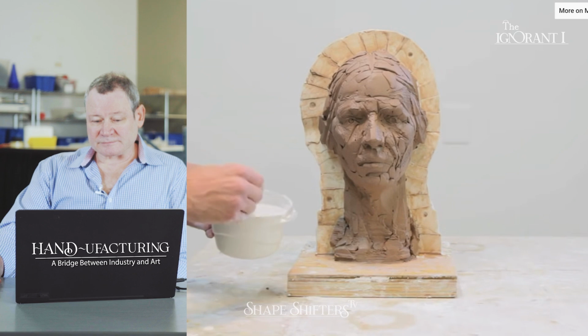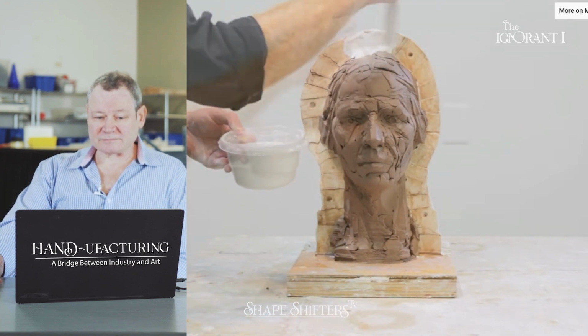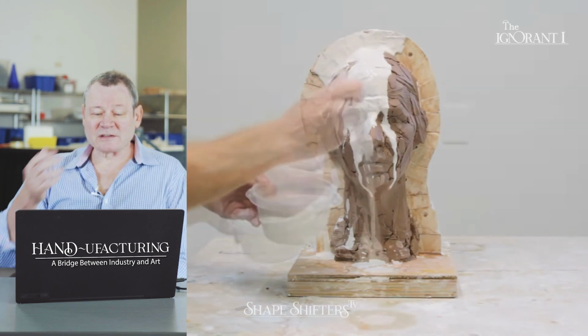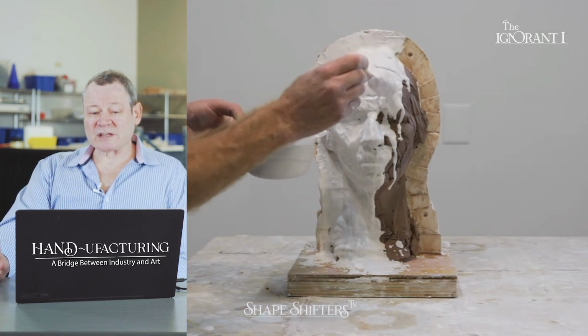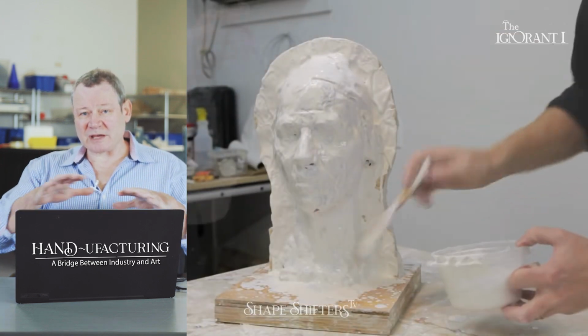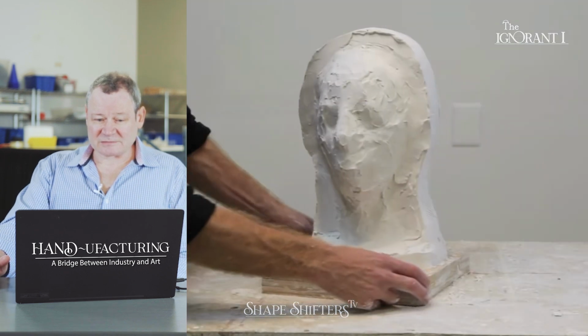Once the slip is applied, then we can mix up another batch of plaster and start to brush it on the sculpture. This guy's nailing it. Making sure we get plaster into all of the crevices. You just have to be careful of those eyes, making sure that we put plaster. But he has a lot of room to correct any mistakes later. After the first face coat, I think I would have added a laminated base of thin plaster to the mold.